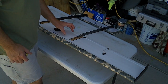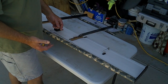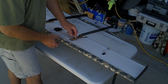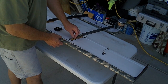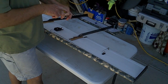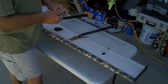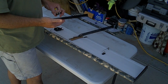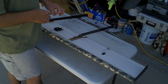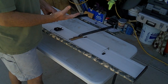Okay, so then the dowels are located here and there, and the reason I'm saying that is because what I do, and this is a little bit on the crude side, is I've wire tied down and around the spar with what's called safety tie wire, and the military uses it to tie nuts onto bolts. So they drill through it and they wire tie it and they twist it, and that's called safety wire. Instead of a locking nut that we trust, you know, when we're not flying, right? We're not an aircraft. In the military, they use locking nuts and they wire tie them so they don't come off and then be ingested into the engine.